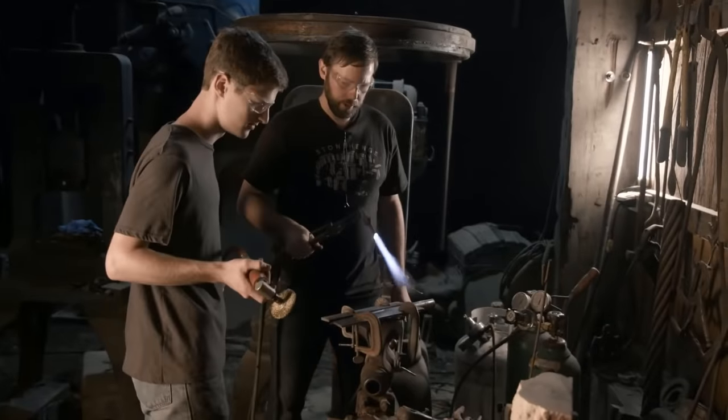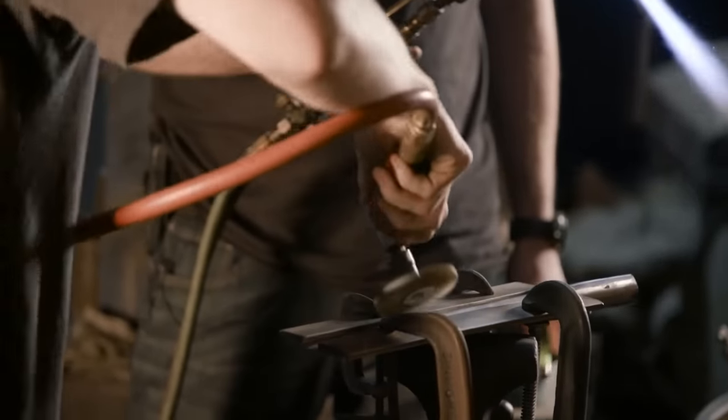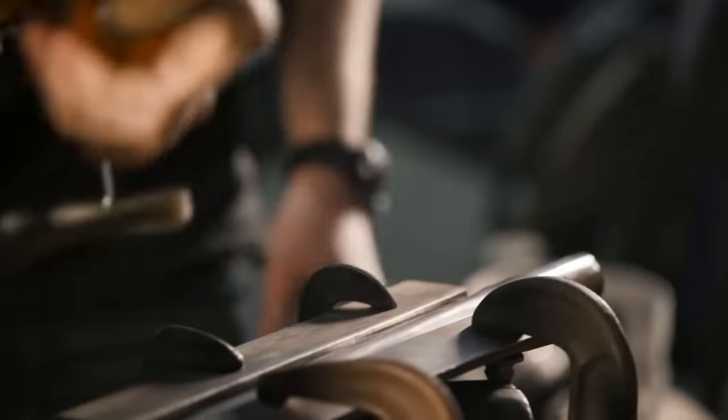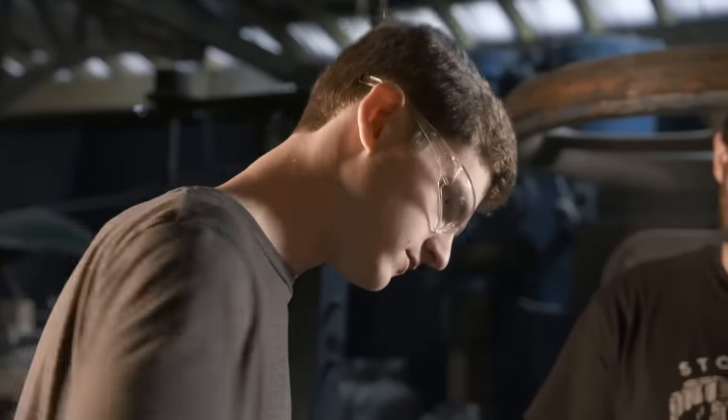Solid brass wire wheel. Rick and Tanner are going to go through, heat up the parts, and then brass them. They've got pieces of steel clamped to the outside of the blade. That's going to prevent the blade itself from being annealed along the cutting edge.